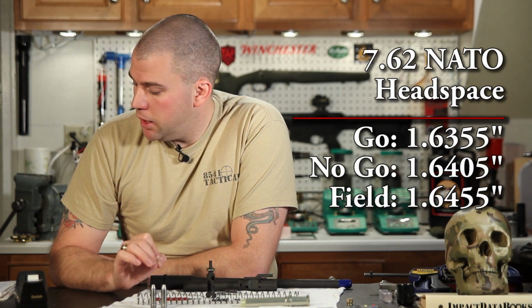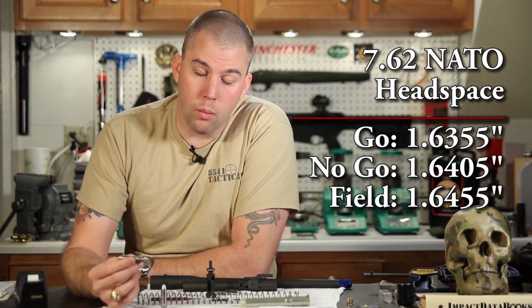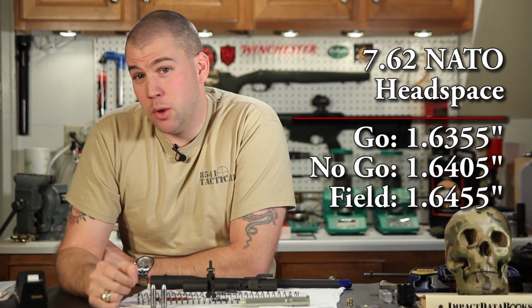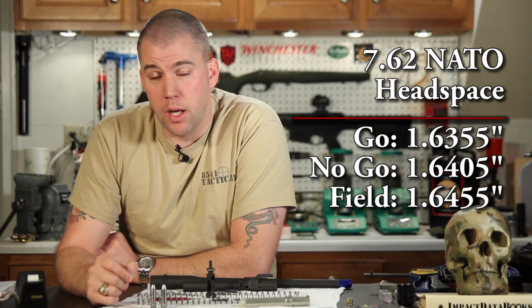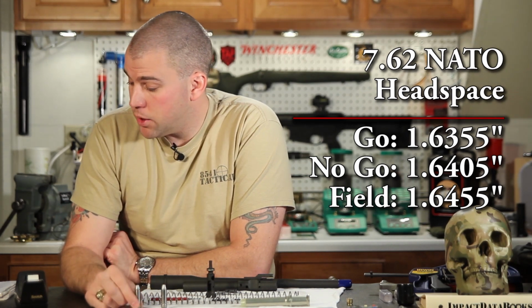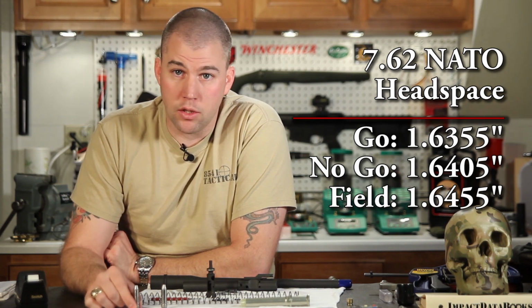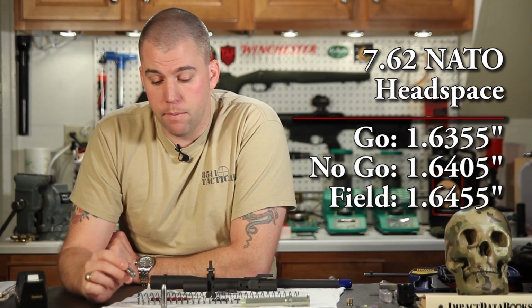Well, if we flip over and we take a look at the headspace dimensions for 7.62 NATO, the go gauge for 7.62 NATO is 1.6355. Well, we know we could close on 1.634 and not close on 1.636. So that tells me we're probably right about 1.6355. So we're about at the minimum specification for 7.62 NATO. We know it would not close on 1.636, and the no-go for 7.62 NATO is 1.6405. So we are well below the no-go for 7.62 NATO, and we're not even close to the field for 7.62 NATO, which is 1.6455.